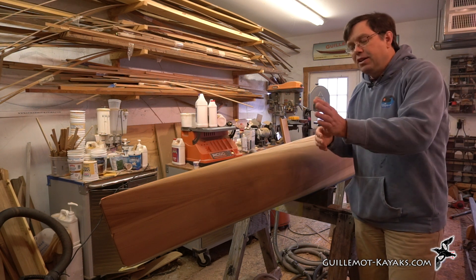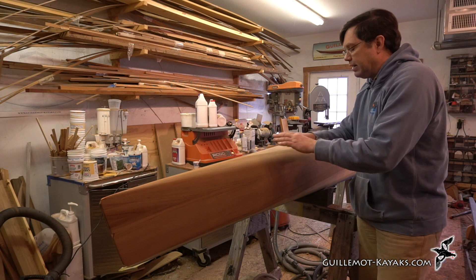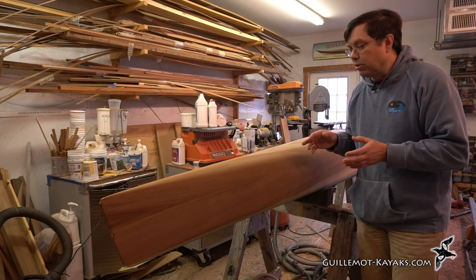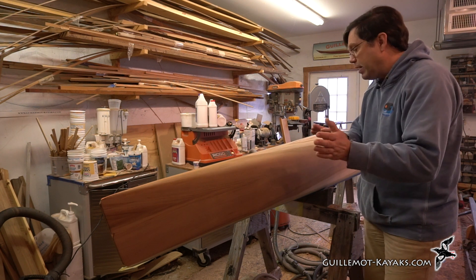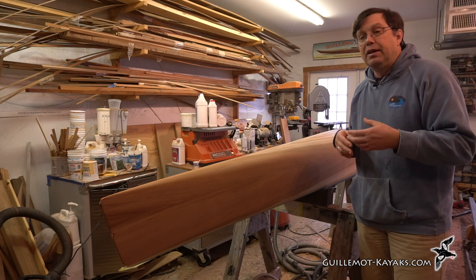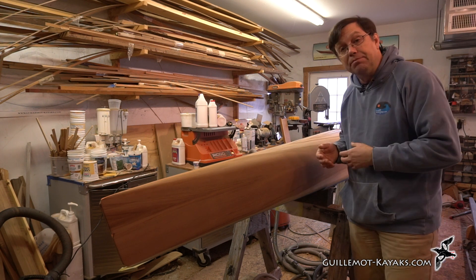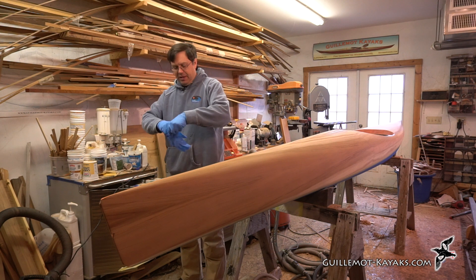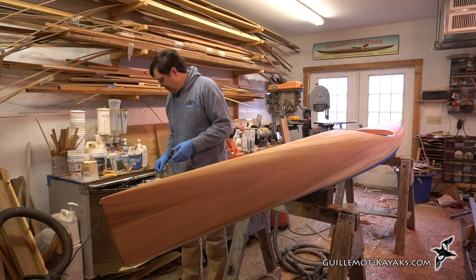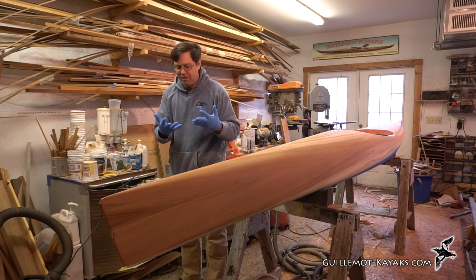Same with this stain: if I had it all stained out and then put my rag down in one spot and let it dry around that edge, that edge will tend to get a little halo or perimeter around it, which is not the look we're going for. It's a matter of trying to keep it all wet as we move down, so I'm going to try and move pretty quickly to get as even a coat as possible. I know that first stain coat won't be all that even, so I'll come back with a wet rag and wipe it all down again. With several pairs of gloves on, I can peel a pair off if I need to grab something and still have another pair on when I need to continue with the staining. With more than one pair on, if one ruptures, there's another set under it.